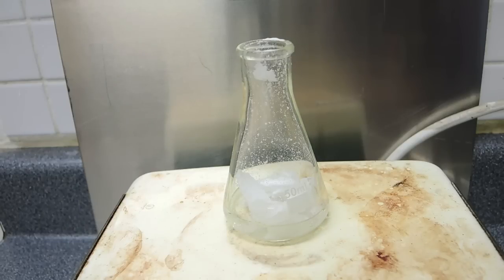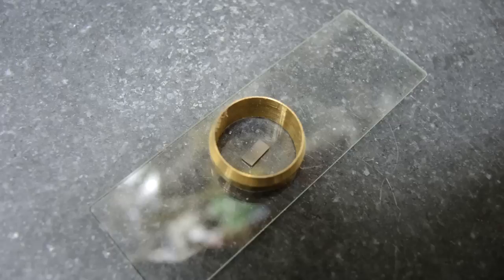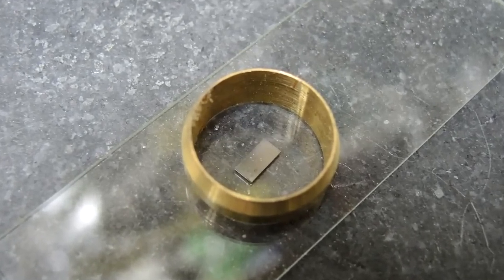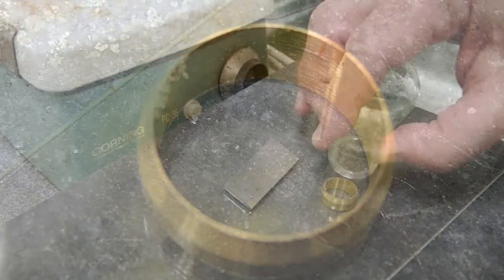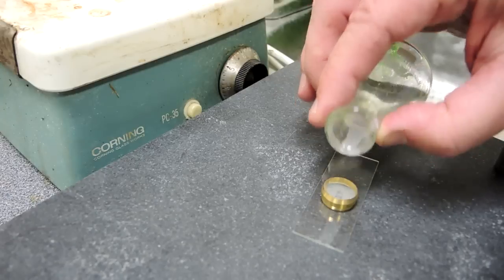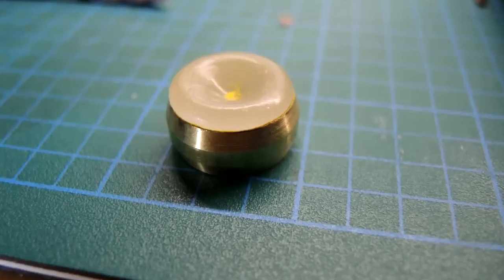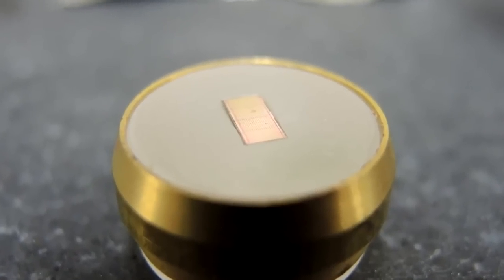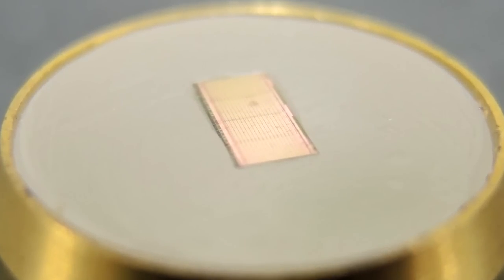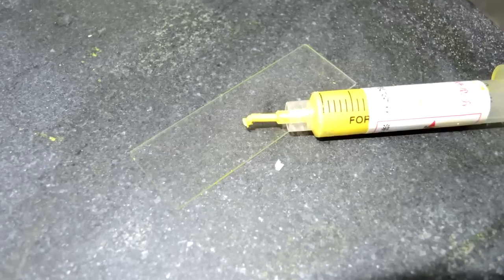I threw it into the flask and melted it down a bit. Then I needed to build a little mold, so I dumped out the contents of my plumbing drawer and found a brass union fitting — just because it's nice and small and rectangular with a nice flat surface. I put the die down upside down, put the fitting around it, and then poured the wax around the die, which allows me to handle it. You can see it's now cooled. The surface on top has sort of a muffin shape — that turned out to be fairly important. Flipping it over, you can see the die appears to be held fairly flat against the wax.